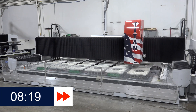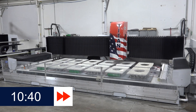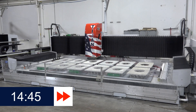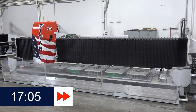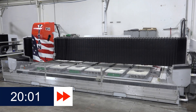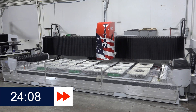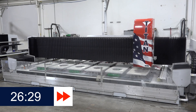Now you're going to see that tool come in and hit the three sides that we're actually going to polish as well as the sink. Basically what we're doing is on the Sawjet, we oversized all of these parts so that we could utilize the overhead laser for placing all of them on our table. When we use an overhead laser we have an accuracy of about a sixteenth of an inch, so we've got to allow a little bit of room for play in there, and then we can bring all that material down to the exact size that we need with this tool.